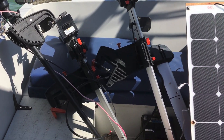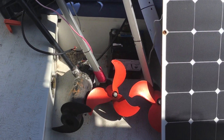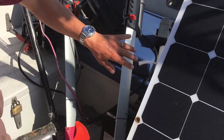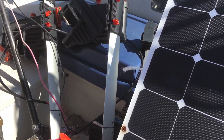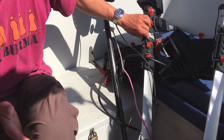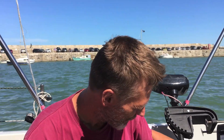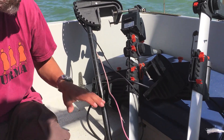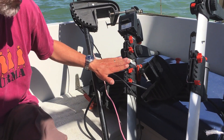The third thing is the motors. We had a bit of trouble with them — two motors stopped working, my two most powerful 24-volt ones. So I ended up using the two 12-volt ones, which actually powered me across the channel when I got the Guinness World Record for the fastest crossing in a solar-powered boat, five years ago. They worked perfectly this time as well on a much heavier boat. This boat is three tons, and they managed to push it along at a couple of knots without too much trouble.